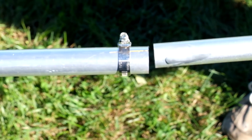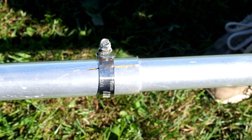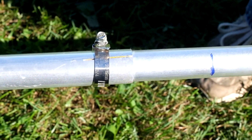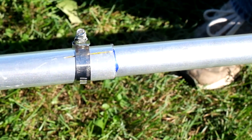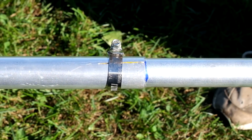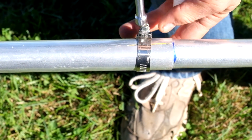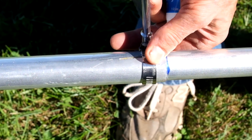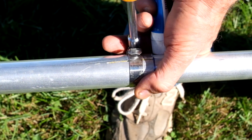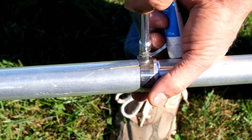With that done it is time to put the telescoping aluminum tubing together. I got all this tubing for this antenna from Texas Towers, which costs about $70 plus shipping. If you add a little antioxidant grease in the joints and slide it together, there isn't anything better or more simple than cutting a slot in the joints and clamping it with a hose clamp.